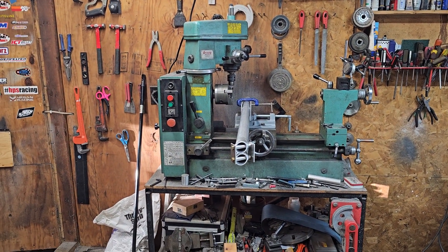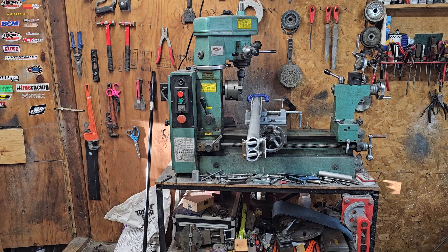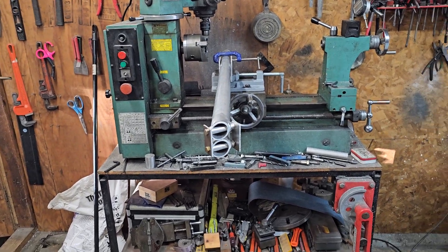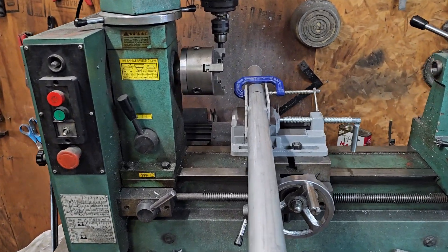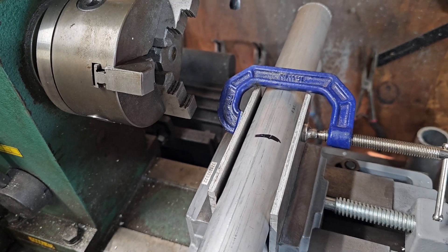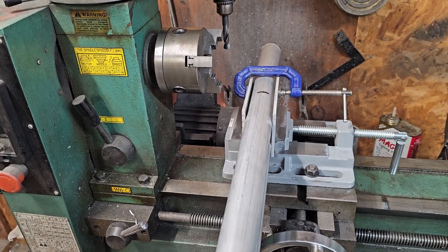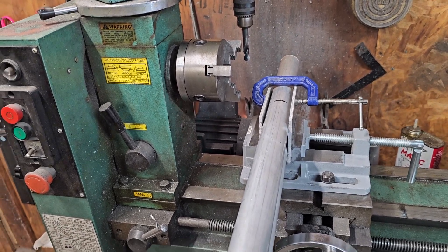The next challenge on the landing gear struts was to drill the holes where the axles go through — they need to be 90 degrees off of where the angle pieces went to hook it to the wing. Made a couple of brackets to hold everything straight and parallel, 90 degrees off, clamped in, everything lined up. The mark I need is 28 inches from the top of the strut. Now I should center up the mill, drill all the way through both tubes, and make it 7/8 inch — that's the size of tubing that goes through there — then weld it in place.